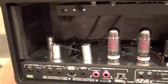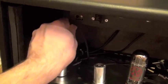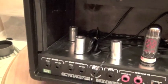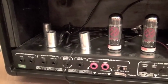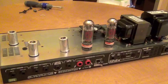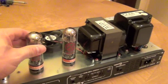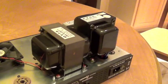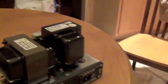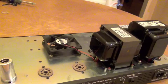Okay, the amp is inverted and the screws are removed. I want to point out for you guys with a reverb tank on these things: there is an actual power plug that you're going to have to unplug to get this thing out safely. After a few choice words the amp is now removed from the head shell. I'm also going to pop out my power tubes because when I flip this amp over I know these are going to be a little bit taller than the transformers, and I don't want the amp leaning on the power tubes.